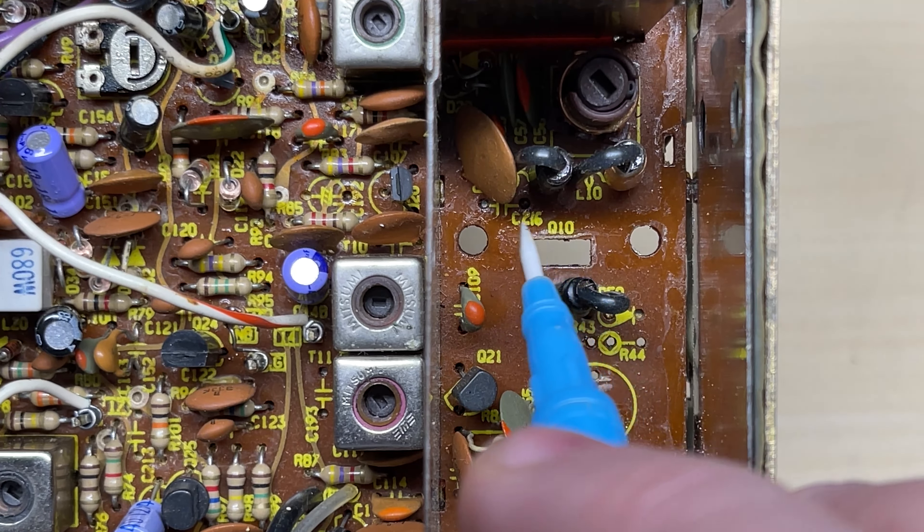So there's the 121 chassis that we all know. It's slightly different to the old 5.9 — we need to remove one more component for this. The components we need to remove are RV2, R43, R44, and obviously the 1969.